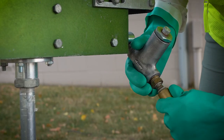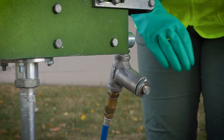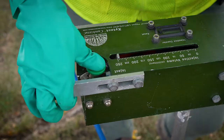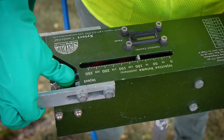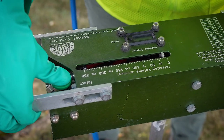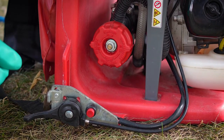From there you are going to want to attach your HTI to the backpack unit with the hose using the quick disconnect. You will also want to insert the tip of the HTI into the backpack reservoir to circulate the product through the hose and back into the tank. This ensures that your hose is filled with product before your first dose and that the product is mixed thoroughly.